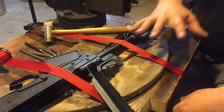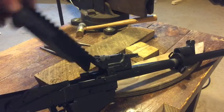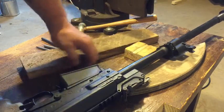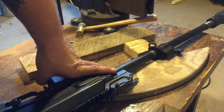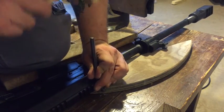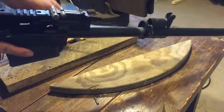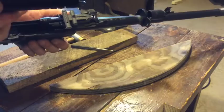I'm going to free the gun from this contraption and get the pin the rest of the way out of there. There she is — you can see the pin sticking out. Now I'm going to lever off the edge of that piece of wood, hold it with a knee, and get the pin the rest of the way out. And there you have it — that pin's out. And the dust cover is free.